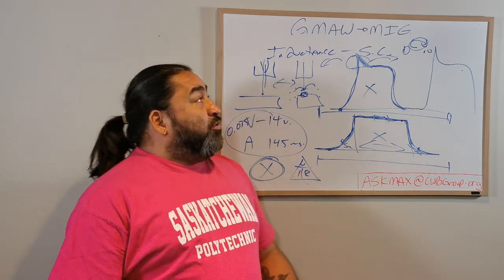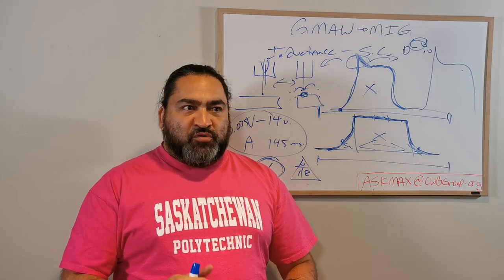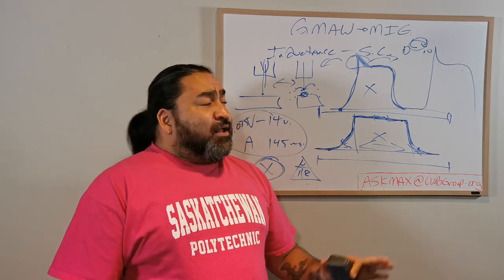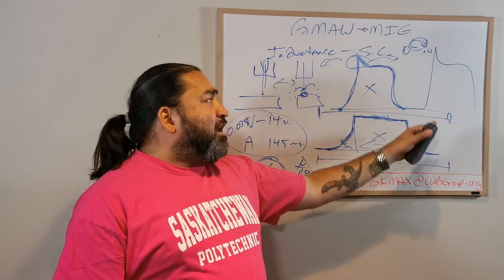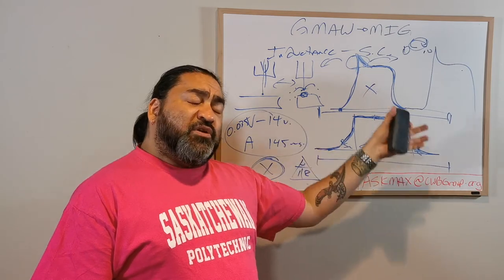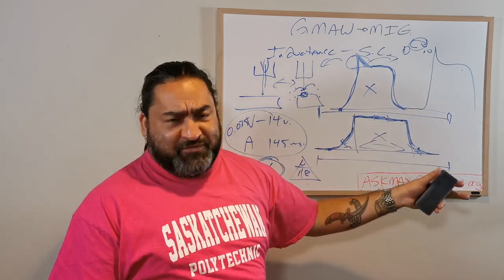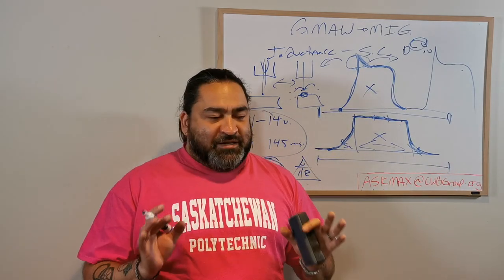Hope you guys like today's episode on GMAW. Today is episode 3. I'm going to record episode 4 this week. We're going to be getting into modified waveforms, which will probably be about 2 episodes because there's a lot of crazy stuff happening. Like, I mean, this happens in a fraction of a second, and inverters are able to make some of these adjustments within fractions of a second. But as we've learned in previous episodes, once we get to modified waveforms, we're talking about 1/100th of a thousandth of a second or 1/10,000th of a second. And we can now really start playing with these power curves and creating different things.